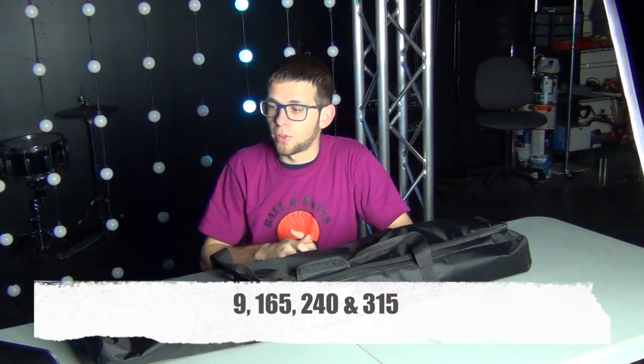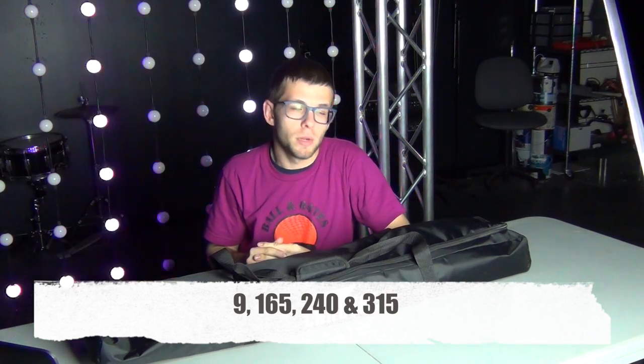The DMX addresses, the channels that it has are 9, 165, 240, and 315. It also has a 3-pin DMX connector. It is 110 LEDs, 50,000 hours of life expectancy. You can plug in 16 of these Motion Orbs all together. Power link these as well, up to 16 of the Motion Orbs together, so you don't have to worry about running power back and forth. No, you just daisy chain them all together and you're all set.